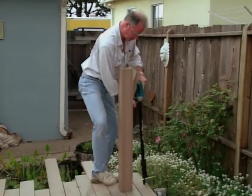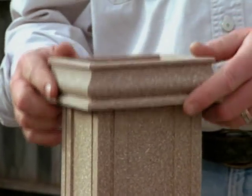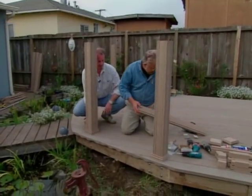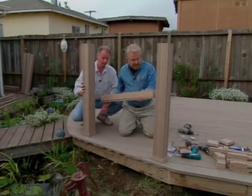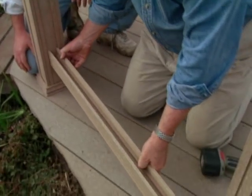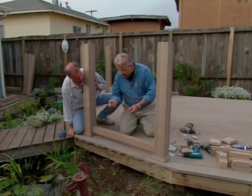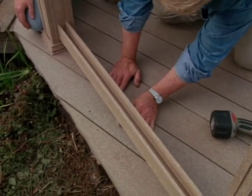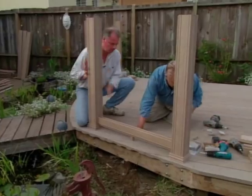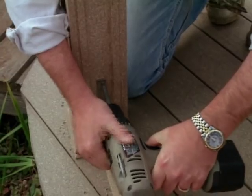With all our deck boards secured in place, we turn our attention back to the railing. The base slips over the post we put in earlier. This piece is called universal railing — it's used on the top and the bottom, fitting into a recess on the post and setting on top of trim pieces on the bottom. We put a short piece of stock in the center as a center support and attach it with a screw. We also install brackets to secure both the bottom rail and a top rail to each post.